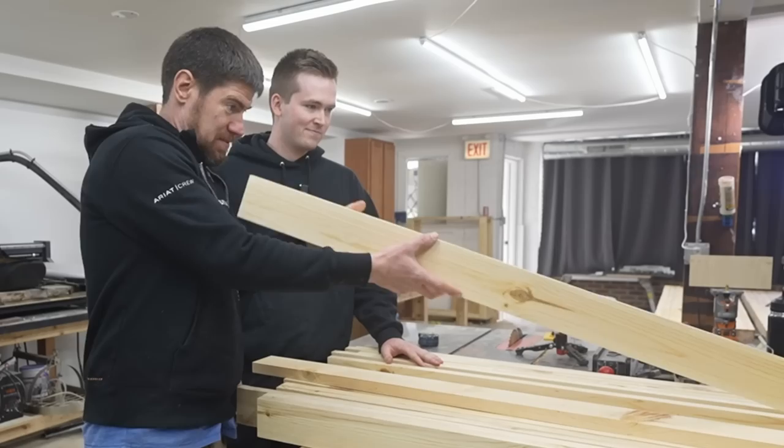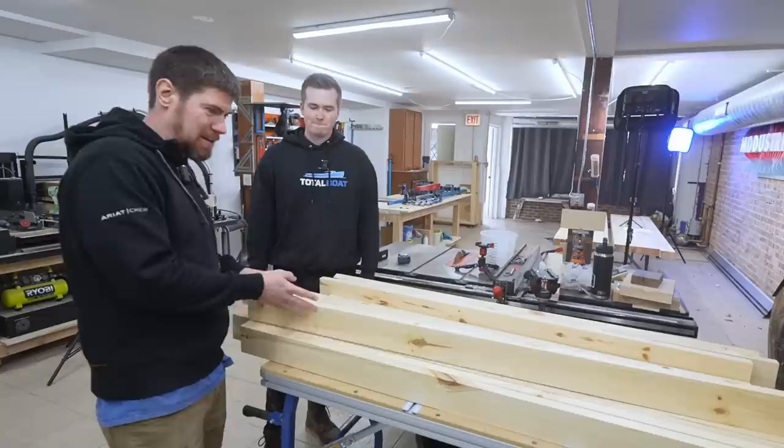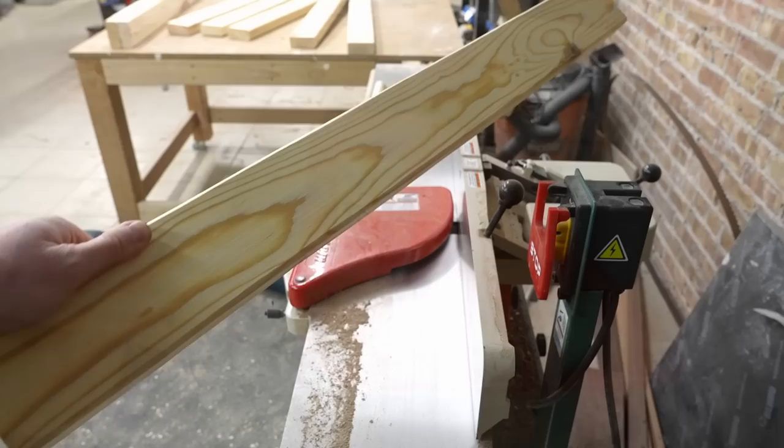So we have a teaching moment here. It's called a thickness planer, which means it makes everything an even thickness — but if there's a banana in the board, it just preserves that banana while keeping everything the same thickness. That means when you glue them up you're still going to have to remove a lot of material later. What you could have done was run them through the jointer first to get the edges even on one side so they'd sit flush in the glue-up. Good lesson — I think a lot of people out there probably made that mistake when they were getting going.